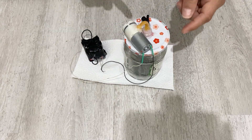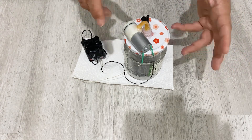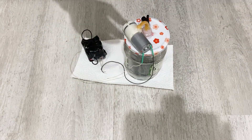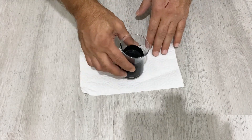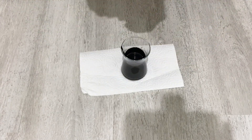In the vacuum chamber I'm going to wait about half an hour, and after that I'm going to stir the paint again for another half an hour. After all this process we will get our very nice conductive paint. Now at this point I am going to add some gum arabic into my conductive paint.